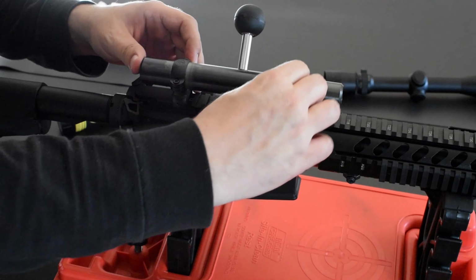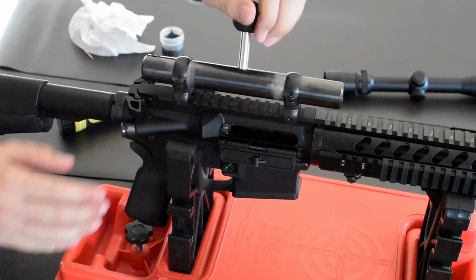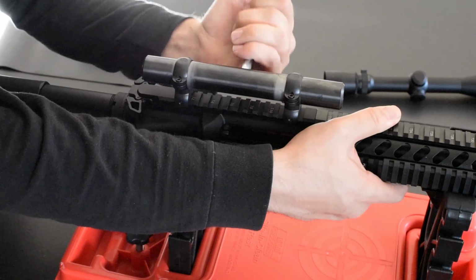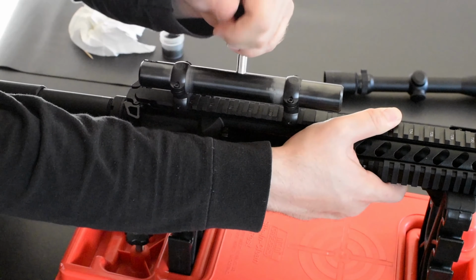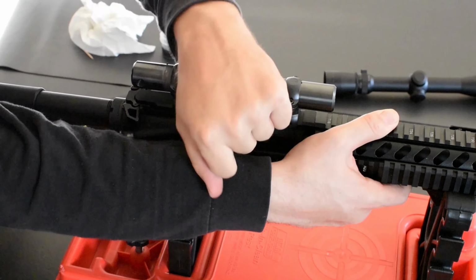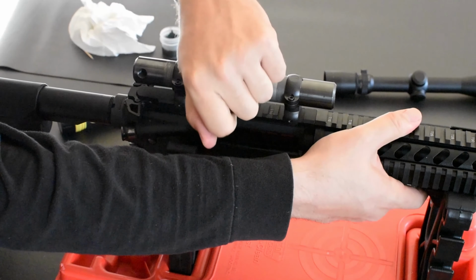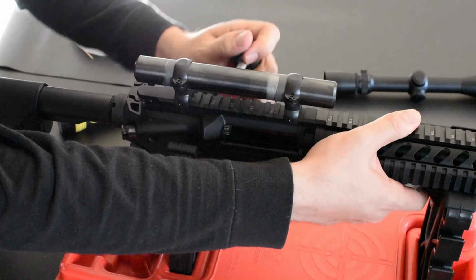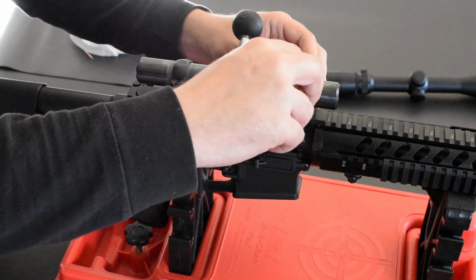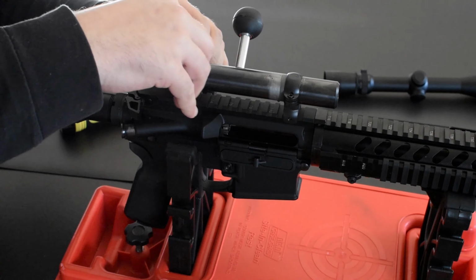Once the lapping compound is applied, seat the lapping bar in the rings and tighten the top rings. Then begin the lapping like so. You will get to a point where the tension becomes lesser and lesser on the lapping bar. When this occurs, slightly tighten the rings a bit more and continue on lapping. Repeat this process until you have your desired results.